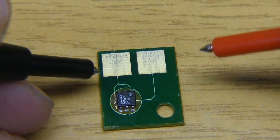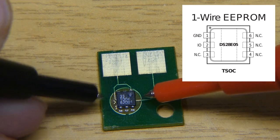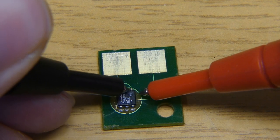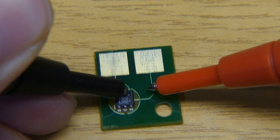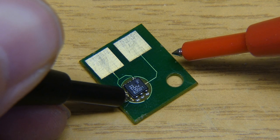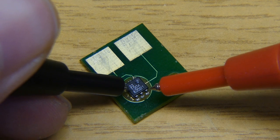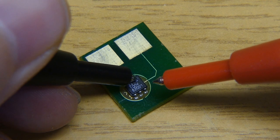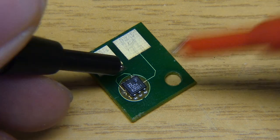And this pretty much matches one wire EEPROM, which very often uses this pinout, and there are chips in this package. So my guess is that this is one wire EEPROM. I said this is pin 1 because here there is the dot on the chip, and this is in the top left corner and it indicates pin 1. If you look at the board, you see that whoever made the footprint added a mark here for pin 1, which should be this pin, and here some kind of indication for the top notch, which is generally on top of the package, and on the left side there is pin 1. But I think they made a mistake, because this notch and this dot on the chip indicate pin 1 in all cases. I haven't seen any other case.